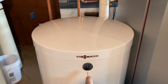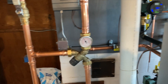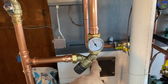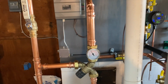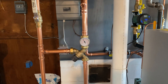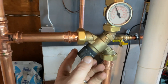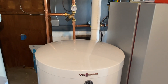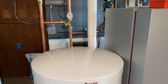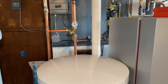We deliver hot water through a thermostatic mixing valve. I keep the tank set pretty high — 140 to 145 degrees — and then mix cold water in with the hot water coming out of the tank to get the set point desired at the faucet. My plumbing code requires 120-degree water delivery, but this is adjustable so they can have 120 degrees or even warmer if desired.